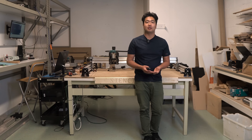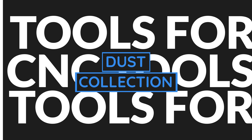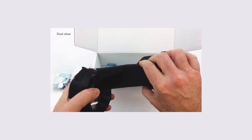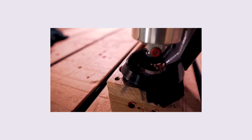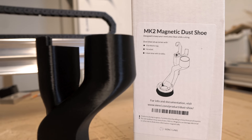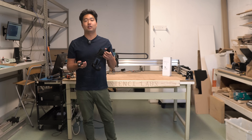We've now covered all of the basic items you need for CNCing. With all the things we discussed, you can make just about any project you want. However, we also have different accessories and tools you may want to get to improve your experience. CNCing can be really messy, which makes dust collection an important part of your setup. At our shop, we use a rigid shop vac and dust deputy, both of which you can purchase for about $200. This sort of setup will be more than capable for any hobby CNC dust collection use. To help clean up dust while cutting, we also have the dust shoe, a $60 USD or $75 Canadian attachment which goes on the front of the machine to suck up dust while your job is cutting. The Mark II magnetic dust shoe comes with a 2.5-inch attachment, so it will work with the rigid vac perfectly and most other shop vacs as well.